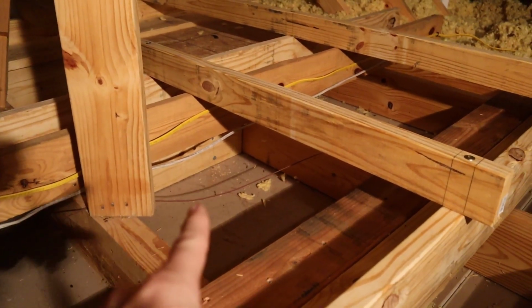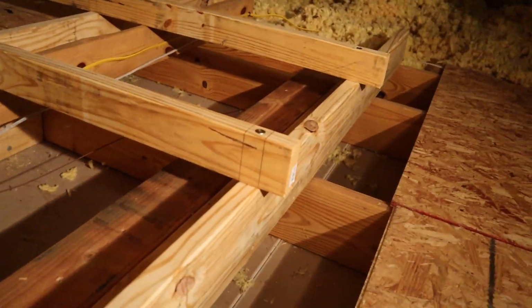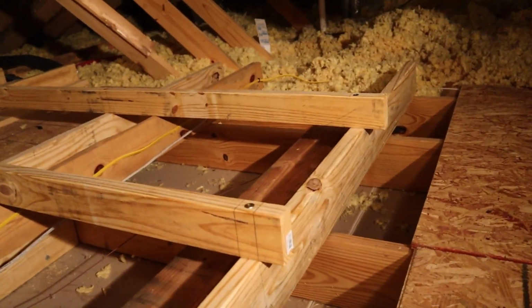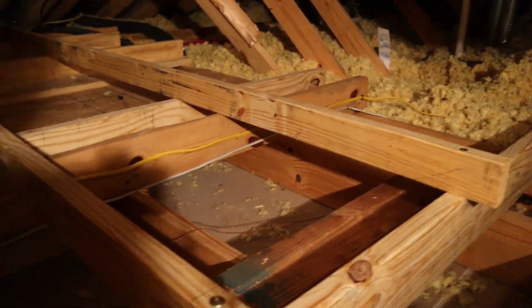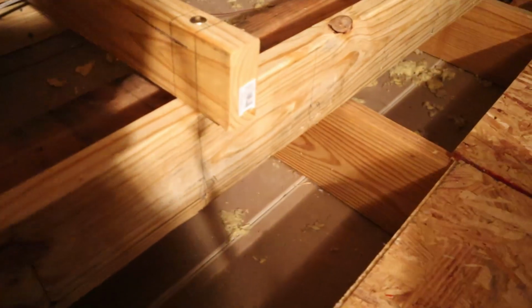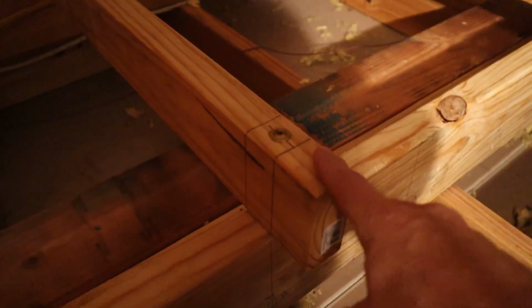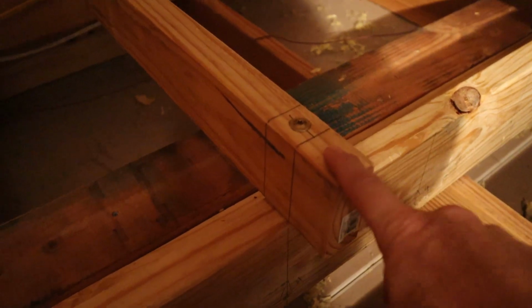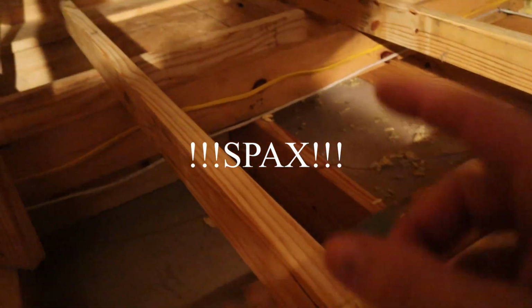the storage shelf itself sits from here over to there, and I put two 2x4 strongbacks that you see running here, all the length. Actually they're 10 foot, so they're evenly spaced. Actually the one run ends right here, ends right there, and then it runs down there for 10 foot. And I screwed these in with 6-inch long construction screws, so I get a good bite into here all the way down.